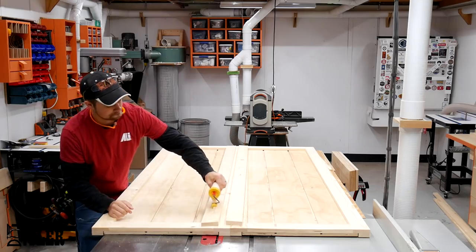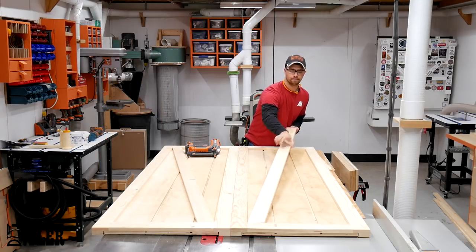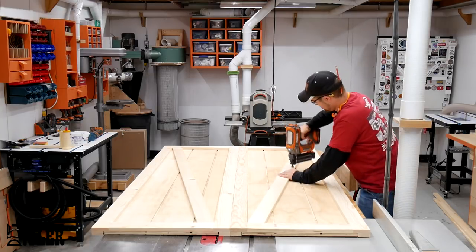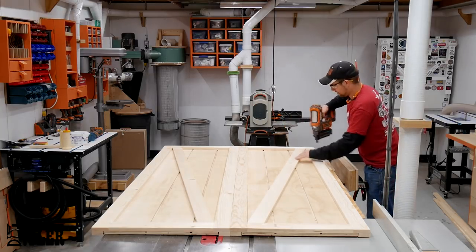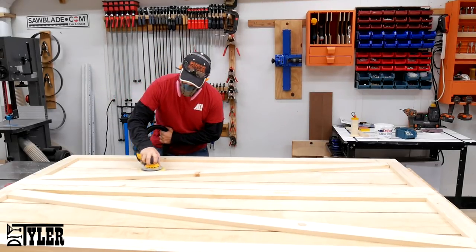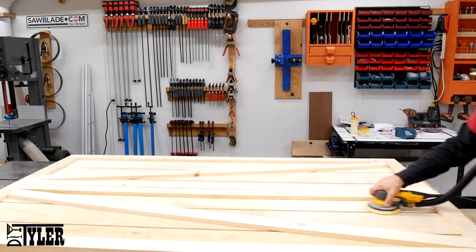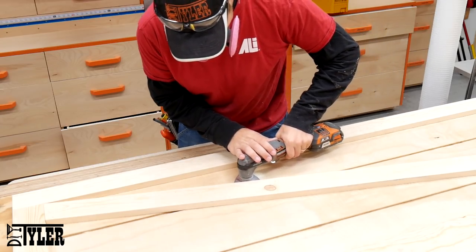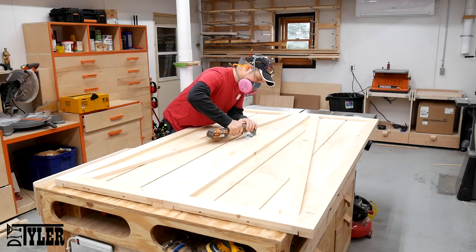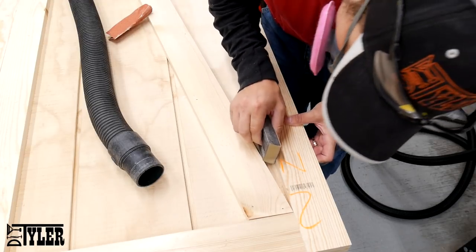Just like the rest of the assembly, I glued and brad nailed that into place. If I was to do this again I would definitely hold back on this part until I did the sanding — it totally would have been a smart idea to sand the T111 and the pine board separately and then assemble. To sand everything down I used my Ridgid random orbit job site sander with a small end and a little bit of hand sanding.